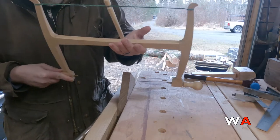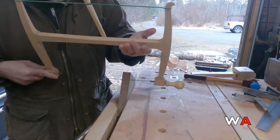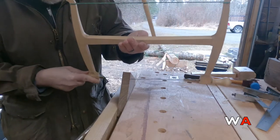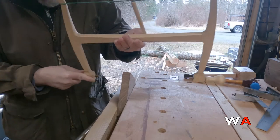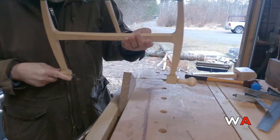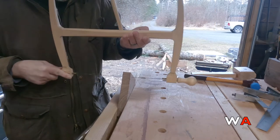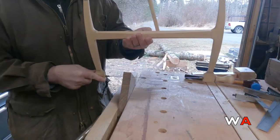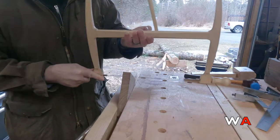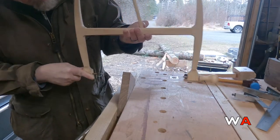If I get relaxed into this I should be able to take full, long strokes at a reasonable pace. I'm not putting any tension — just enough pressure to keep it from falling out of the curve. It's a slow, even pressure and a nice, even, long stroke. The left hand is very gently guiding the saw blade, making very slow, gentle adjustments. Quick adjustments give a jagged, bumpy cut; slow adjustments give a long, smooth cut.